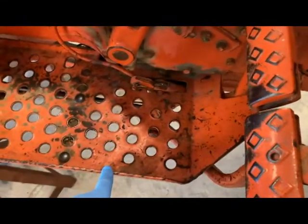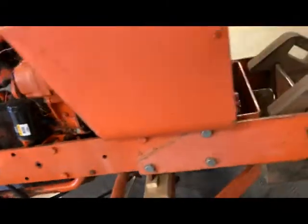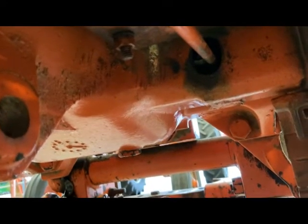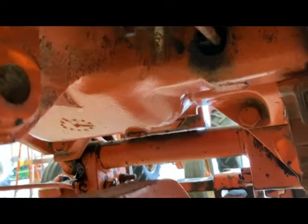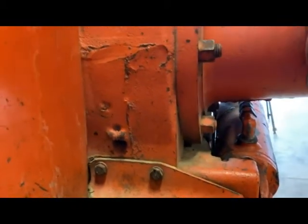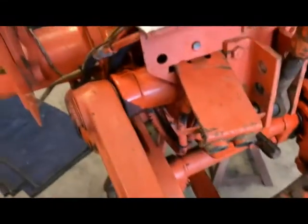There's a spring on the other side that's underneath the foot rest and it is in fine shape — it's not stretched or anything. You have to look a little deeper on it. I think what we might have going on is up there where the brake rod goes in is just full of junk, and there might be enough stuff in there restricting that band from opening all the way with the pressure of the spring. Both of the springs on the band, front and rear, are still in place and look fine.